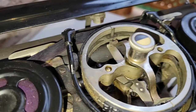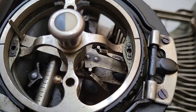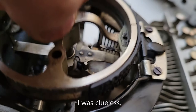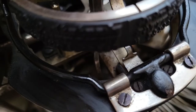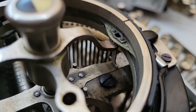Here you can see on my working Hammond multiplex that we have this spring-loaded thing and it rests fine. But on the other machine, something is preventing it from fully falling. I found what was wrong — this tab here was bent up way too high, acting as kind of a shock absorber. I just pushed it down. So this machine doesn't have it, but here it was bent down and is supposed to be pulled up quite a fair bit. I have no clue how that happened, but I'm going to fix that. That just keeps this guy from flying around.